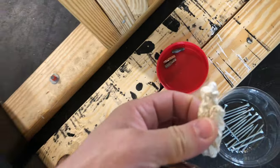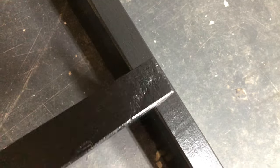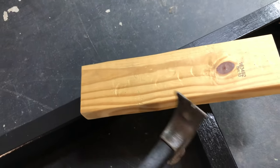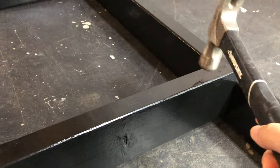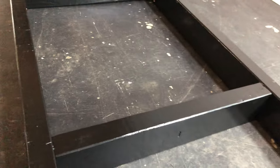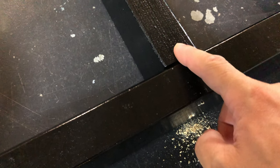I've got a wax marker to mark 12 and a half from each end on both sides. Grab the side piece, find the center, and often you'll have to smack these in because you're going exactly to the same spot plus with the paint coat. Work it in — try not to fight it too much. If you have to use a hammer, hit a board rather than hitting the piece directly unless you're just barely tapping.